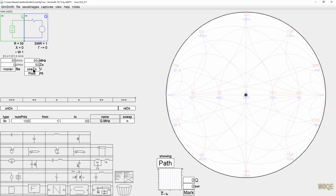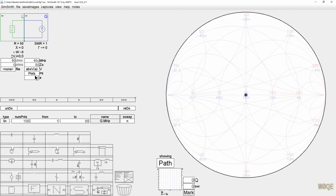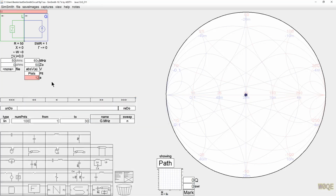We're going to change the generator type since it's a 120 volt application. The source impedance is very low, so let's make it an absolute voltage type. And have it set to parameter A is just fine. We could put a voltage number directly in here also. It wouldn't matter. We'll leave it this way. And I'll come down here and I'll set that to be 120.